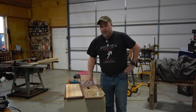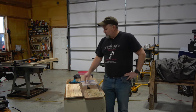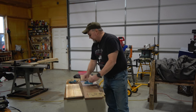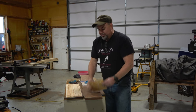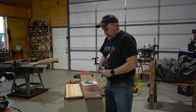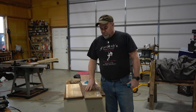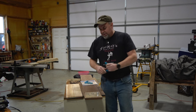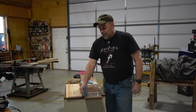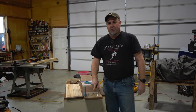What we're going to do today is use walnut and start to build and leverage this template. One of the first things we're going to do is use the square piece. The first thing we have to do is just make sure — I know that this board is not a straight edge, and that's not really a big deal because imperfections can be used to really beautify your project. From a centering perspective, we'll use this square to make sure we've got it in the same spot, and then we're going to clamp this down.